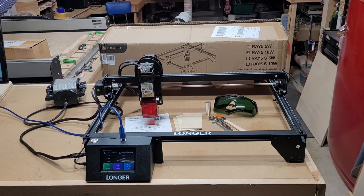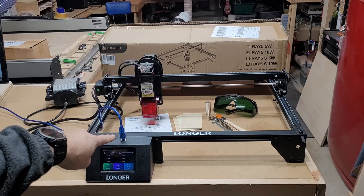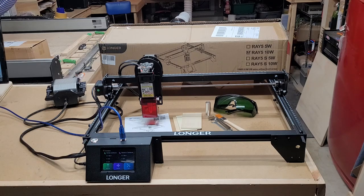So again, open frame style diode laser engraver machine. Just to go over some of the features: it has a couple really nice features — behind the control panel near the blue USB cable on the back side is a flame detection sensor, so if your material would happen to start burning or overheating, that would shut the machine off. That's a good feature to have. It also has a movement detection or crash detection, so if you bump into the machine while it's working, it would shut off.